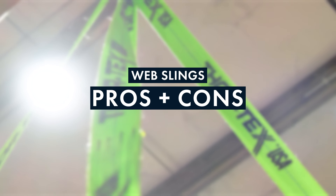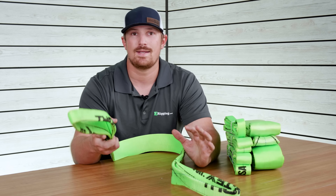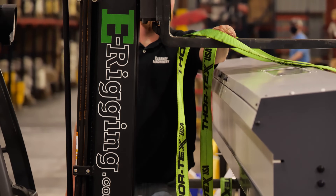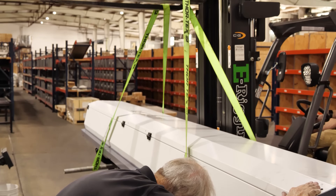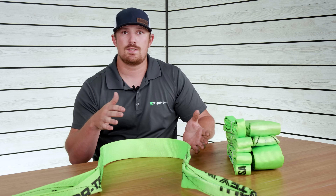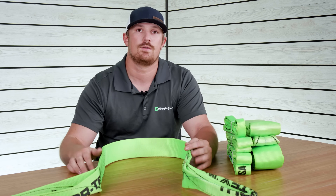So why would you buy a web sling? Well, web slings are very dynamic, they're very strong, and you can use them for a wide variety of applications. But where they're going to specifically shine is in cases whenever you need to try and keep that load level. Since it has two eyes at either end of the sling, you have two attachment points — like for a forklift, you can attach one eye at one side and one eye at the other to keep that object level. They're also great whenever you need to put the sling underneath an object like a piece of machinery and not damage any panels, keeping the load completely supported as you're lifting and moving it.